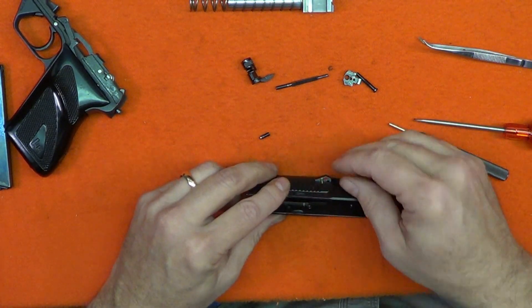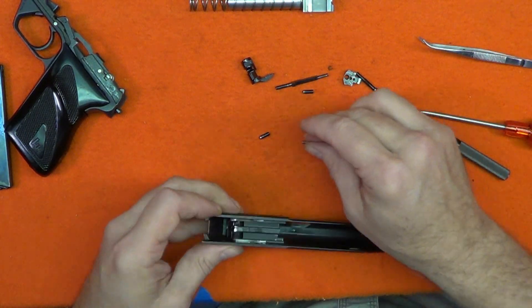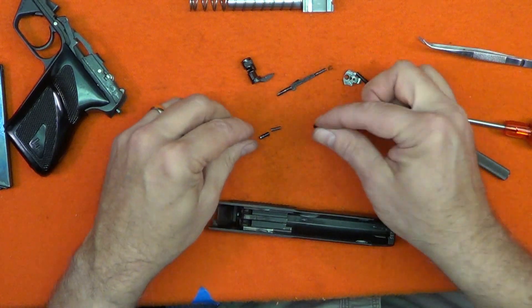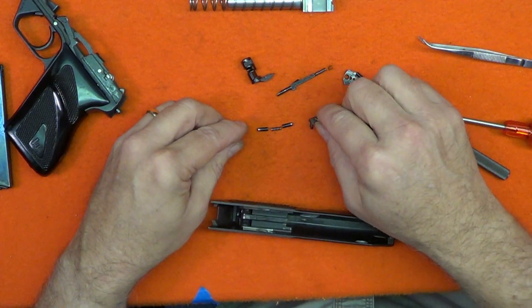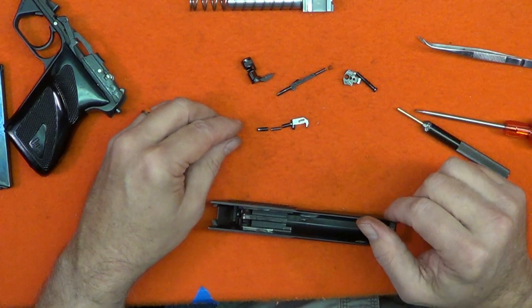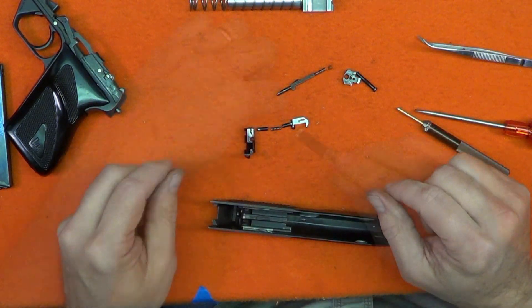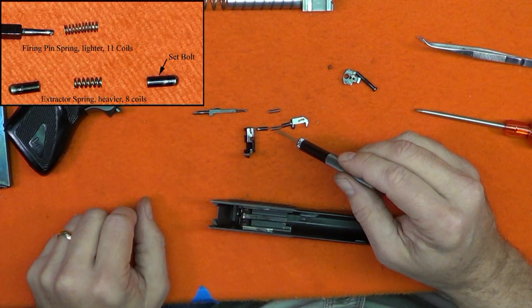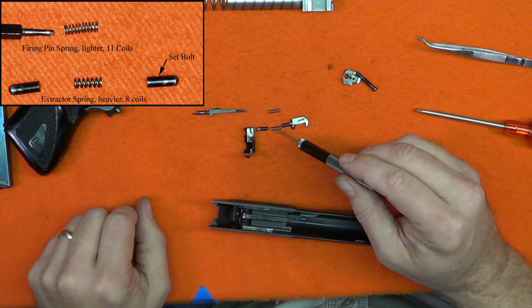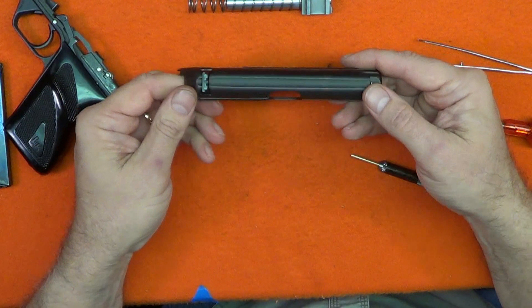Be sure to account for all five parts. The set bolts have a round end and a flat end. The spring fits between the two set bolts, and the flat side of the set bolts face the spring in the middle. The round end of the set bolts face the extractor and the safety. Note there are two very similar springs in the slide: the firing pin spring has 11 coils and is lighter weight; the extractor spring has 8 coils and is heavier. Don't mix them up. That completes the disassembly of the slide.